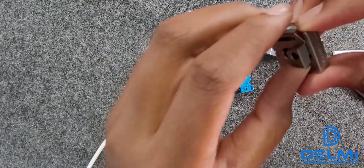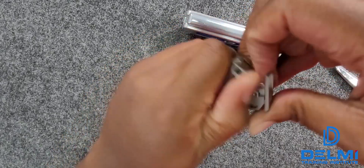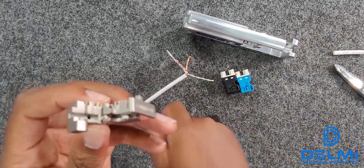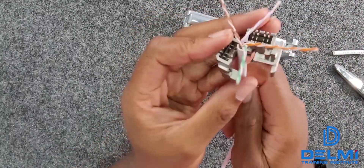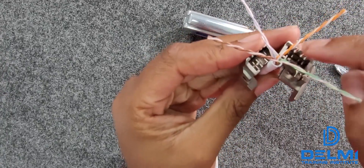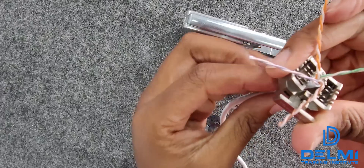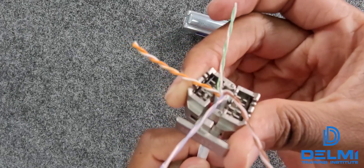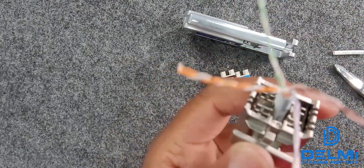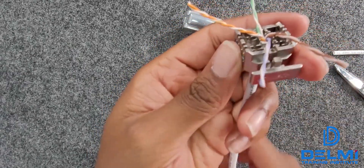The first thing you want to do is open the tool. Hold on to this side and this side over here. Pull with your index finger and push with your thumb — like this — and it opens up. Then you want to put your cable into the tool facing like this, because you want these cables to be fitting into these slots. Make sure your cable is not sticking all the way out, but just flush like this. Then close your clip — you might notice it's moving a lot, but once you push it, it stays in place.